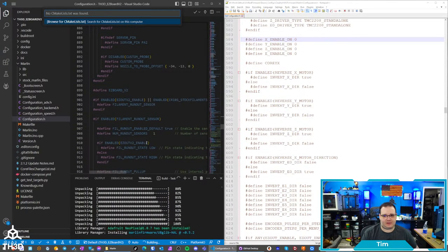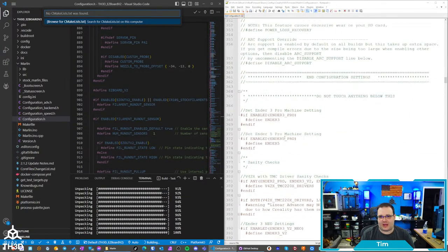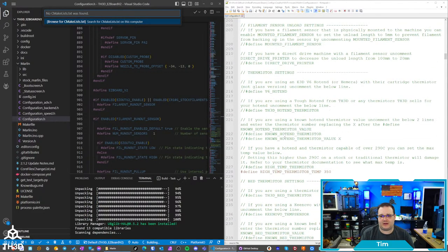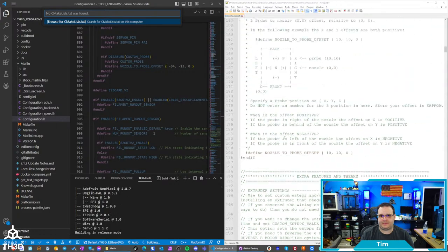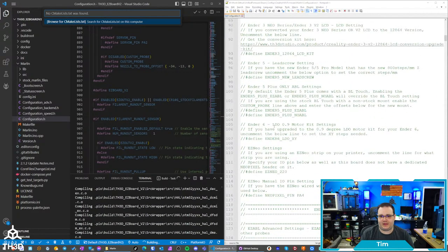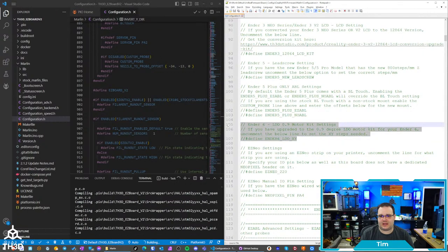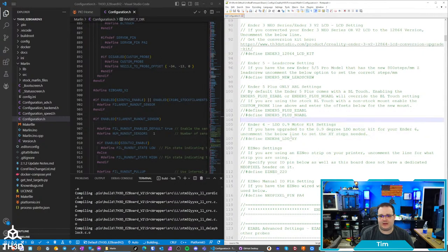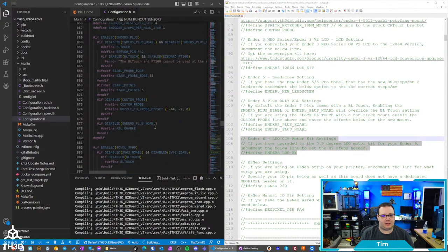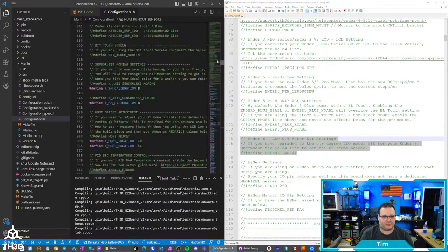I do need to have it. So I think in the stock board firmware, I have an option to disable the filament sensor. So I'm going to carry that over to this config. I thought I saw a note in here. Yeah, so I want to add the LDO motor kit options in here in case people are using that. So that'll require another setting change.